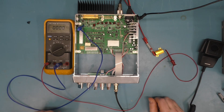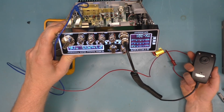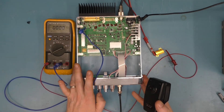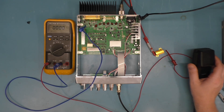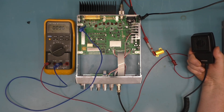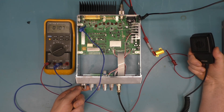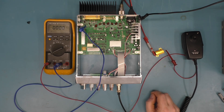Note the current value before adjusting — in this case it's at 134 milliamps. We're going to adjust that value until we get 100 milliamps when transmitting on the radio. You can see it reads 95-96, and changing the adjustment brings it to 106-107. Getting it to 96-97 is about as close to 100 as we're going to get, so that one is fine.